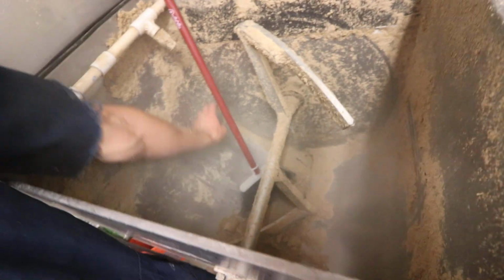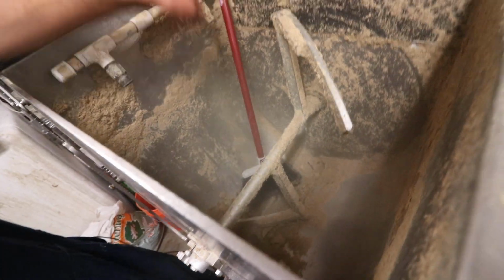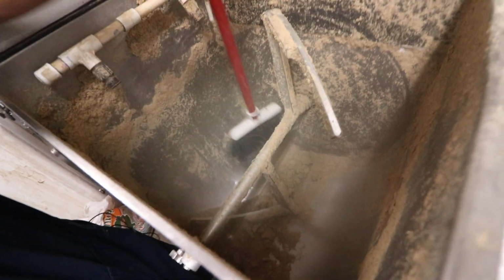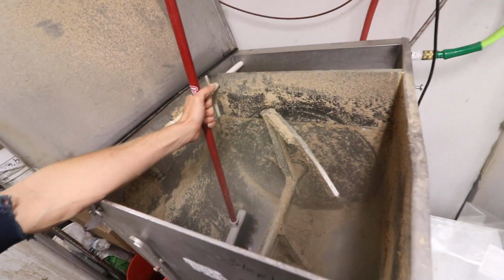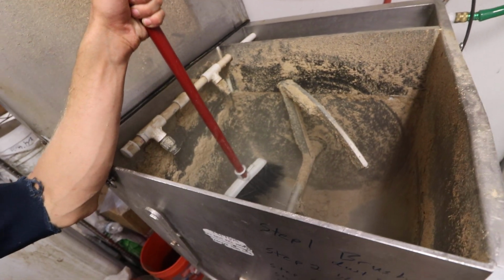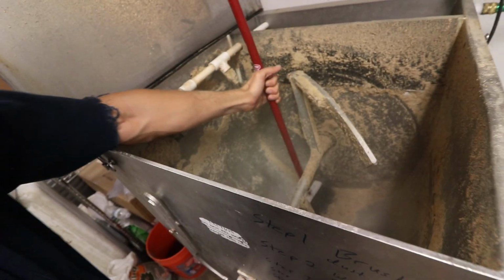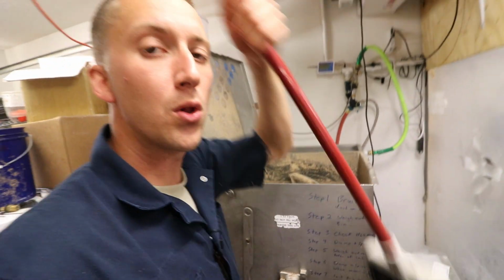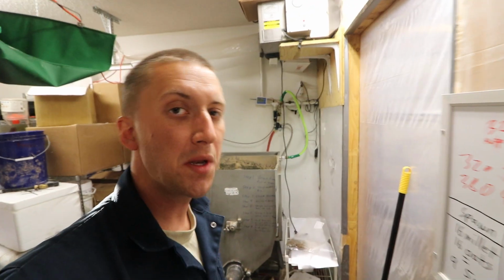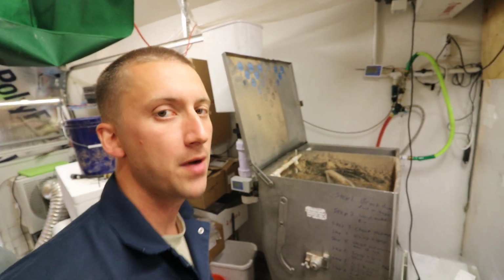And just for those that didn't know, this auger only works when I have the mixer on counter rotate. So when it's on mixing mode, only the top one works. And then when it's on feed mode, this one and the bottom one spin together. It uses something called a roller clutch. A roller clutch is basically like little bearings that only engage when it gets spun one direction.